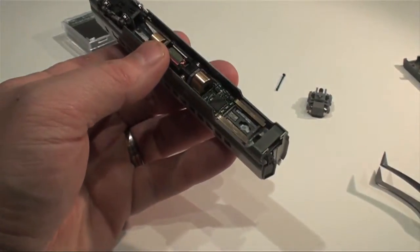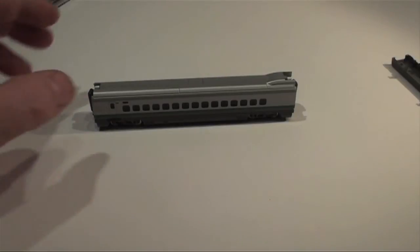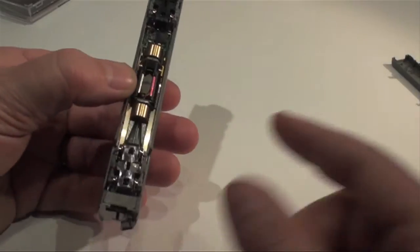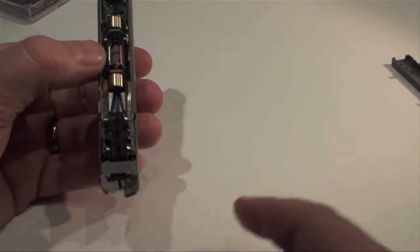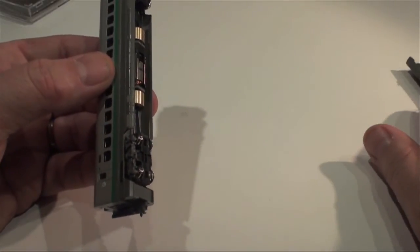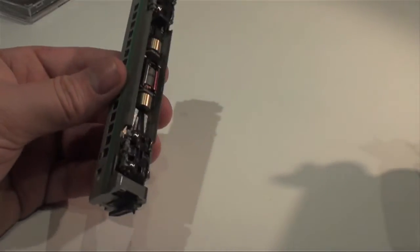So, I am really pleased to say, and a huge round of thank you to Captain Bolivius, that solution worked. Inserting those little strips of styrene underneath these contact strips was the problem, and I now got good contact, and it's working. Now I just need to figure out what's going on with the lights from the function decoders and the cab cars, but the motor car is working on address 3, put it on the layout, it took off like a rabbit, and it's ready to go.